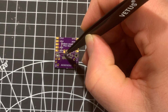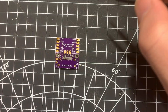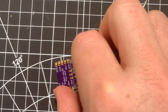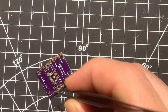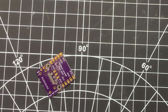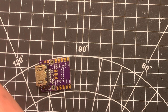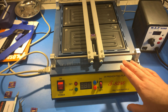That's the one I decided to place the components on. You can see me beginning to put these tiny 0402 resistors on the board. Be careful not to get solder paste on your tweezers because then the resistor sticks to the tweezers rather than the board. Keep your tweezers clean throughout, and getting good at dropping the resistor right over the pad without touching it is definitely a skill you can learn. The DVI connector lines up pretty well and the board is ready to be soldered.